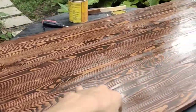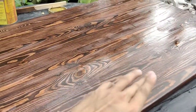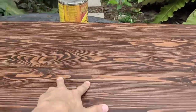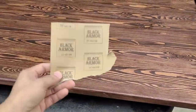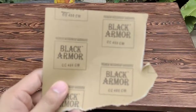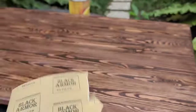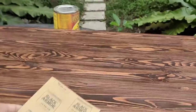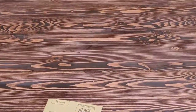I'm going to do two more coats and video the final product. Our first coat has cured and is dry to the touch. Before we apply our second coat, we'll hand sand it with 400 grit, then apply our second coat, then 400 grit again. Finally, after our third coat I will finish sand with 1000 grit so it will be super smooth.